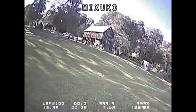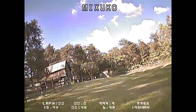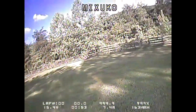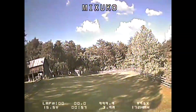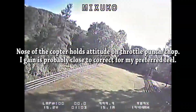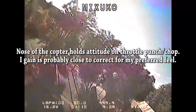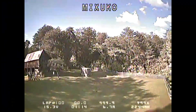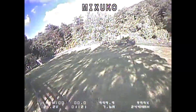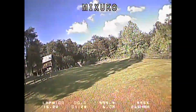I can see the oscillation in the video too. I wouldn't go any higher for sure, but let's see if we can leave it at 6.5 and tame it with D-term. Let's also try some I-term tests. When I cut the throttle, it doesn't do anything unusual. Sliding sideways, it stays pretty solid. The I-terms now, I feel like, are close to where they need to be.